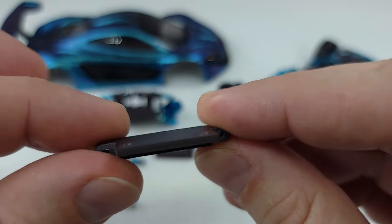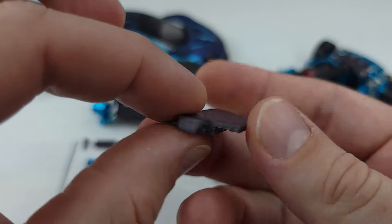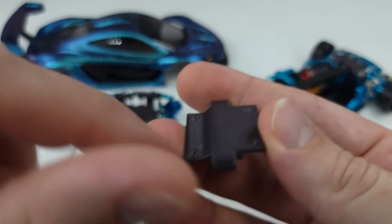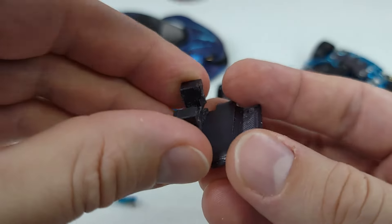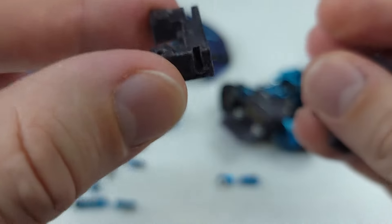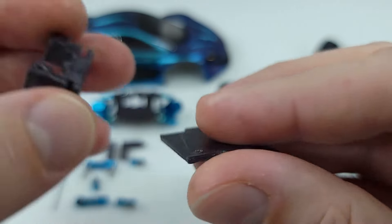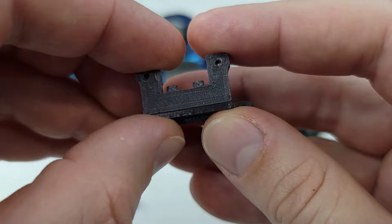This is where the swing arms go, pretty much the same thing as the plastic housing, just without the top half of it. I couldn't really do these as one piece — I tried, but it's really fragile, especially when you print it out. Because I can lay this flat on the 3D printing bed and let it print like this, and it's pretty solid and sturdy when you print it flat. But if you were to print the top on top of it, all the layers are easy to break if you put any pressure this way. So making this into two pieces and then screwing them together was actually a lot stronger way to do this.